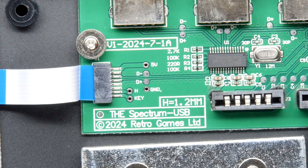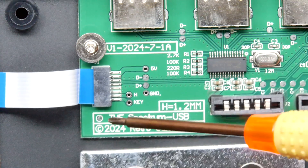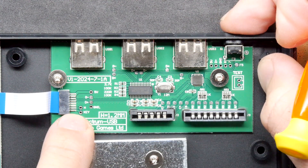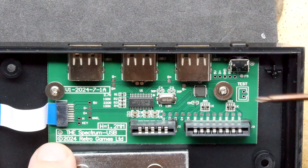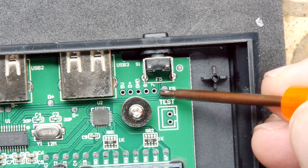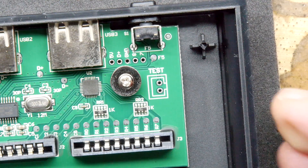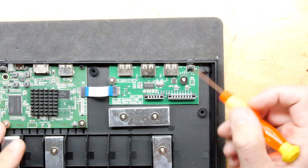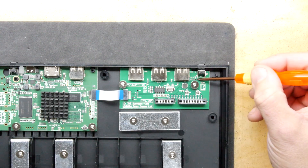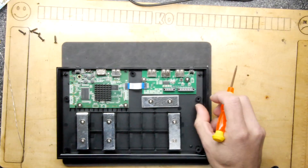You've got your 5 volts, D-minus, D-plus, and ground, then a few additional pins. Moving to the other side you can see 5 volts and ground pins exposed, and your USB pins, but you also have H and KEY. I suspect KEY is connected up to this button — it could be pulling to ground or joining H and KEY. You can see the USB pins exposed again — there's also two pins here marked possibly B on its side, and a test pin. So if you wanted to add internal hardware, you could tap into that. Maybe this controller chip goes out to four USBs and one is unused internally — you could wire something in, like a wireless joystick or wireless keyboard.